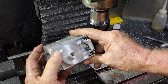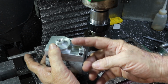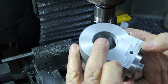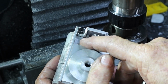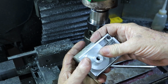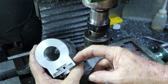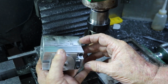Alrighty, so that's that. Put the hole down through here now, so I'll thread that M6 and make up a knob for here. Got to make up a plate for here yet, and that's pretty much that all done. I've got the little shim in there. To retain that shim, what I did was I machined a little 0.3mm recess just in the corner there, and then bent it at 90 degrees so it sits in between this and this to stop it from coming out. That fits beautifully in there. I do want to drill through here and put a couple of screws in that. Don't know whether I'll go 2 or 3 yet, but that won't be very big. Might only be M3s, maybe M4s, because that's only 5mm deep in there. But anyway, we're getting there.